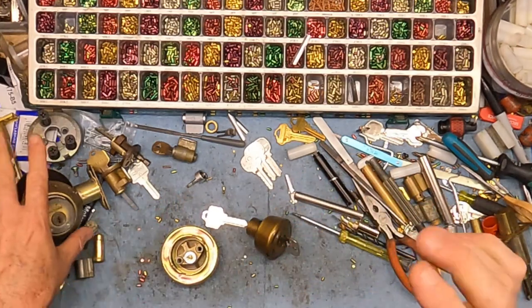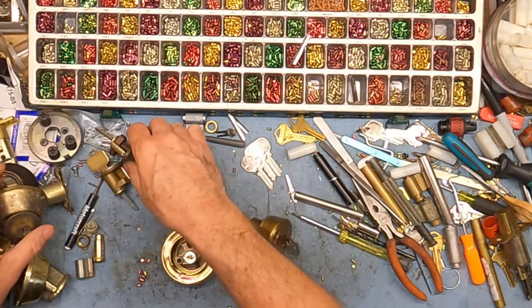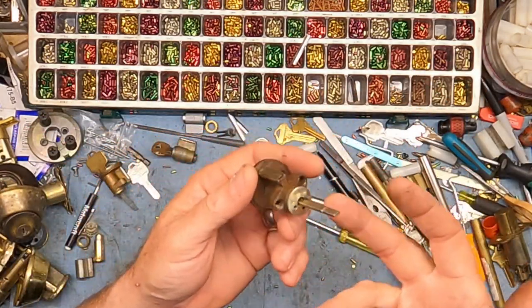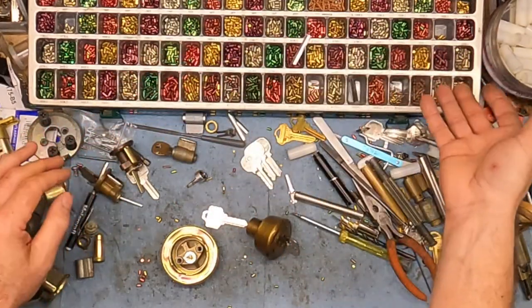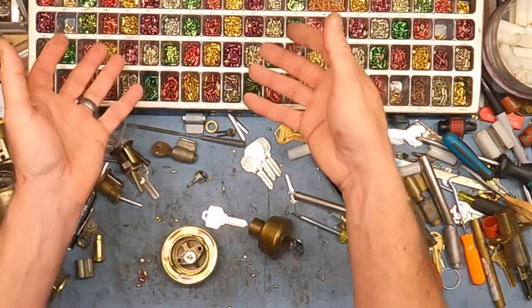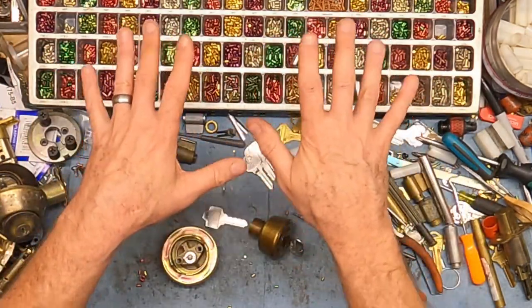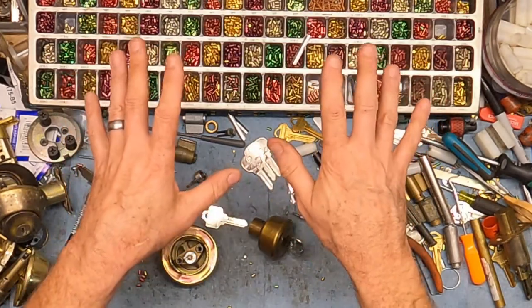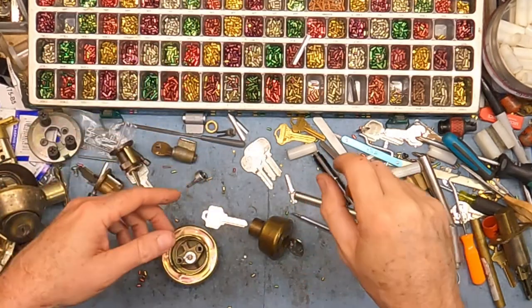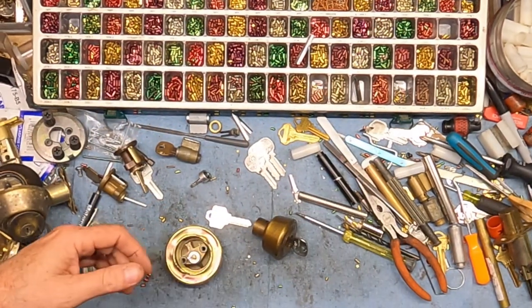We're going to get this put back in. Remember there's a notch on this cap — it goes into the bible. If you put it the wrong way you're never going to get it in. One thing that always gets messed up is your notch on the bible — make sure your holes line up, grab your pin, push it into the plastic, grab your hammer, get it in there centered, slightly below the surface. Put your finger in the hole, push the plug in until it's touching your finger, then use your finger to guide it around. Westlock and National with the half-inch core types use a regular plug follower; the smaller diameter plug will use different pin depths.